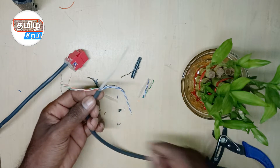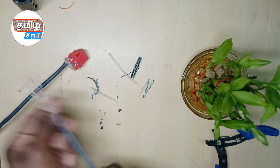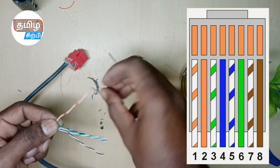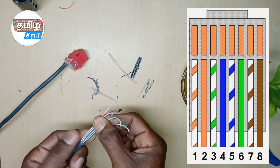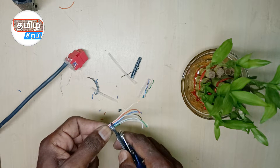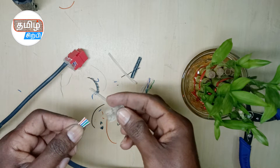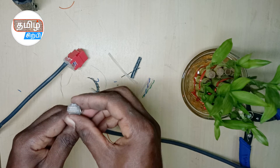Around here you can get the color coding. Here is the color coding — you can see it. The color coding is B-type. You can check the color. Let's arrange this color — we will cut and order each color wire according to B-type, then cut them even with the RJ45 connector.